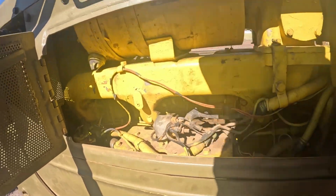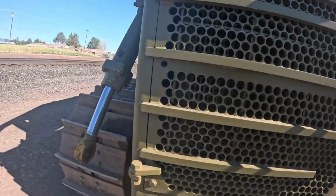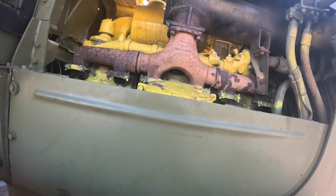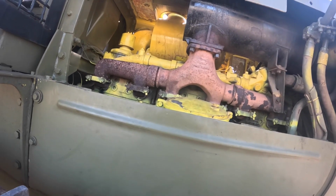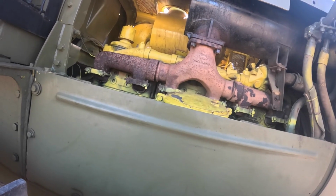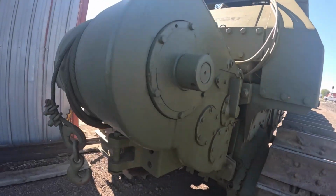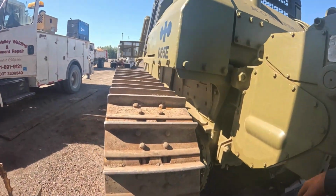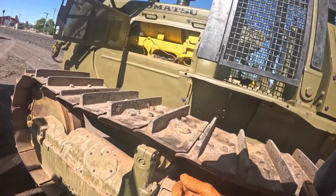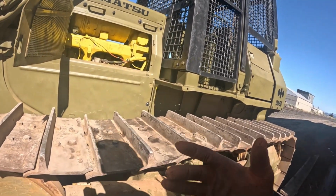And the other thing... Okay, figured out how this tank works and what the purpose of it is. Okay, the whole purpose behind this tank, and now I know why I have that fuel knock after I shut it off and go back to restart it. You kind of have that fuel knock and that big black smoke come out. The design of that is, the tank is obviously sitting higher. On a regular injection pump, this has a Cummins PT fuel pump in it, most of the time you'll either have some kind of vane pump and then your distributor pump, or an inline pump with plungers and delivery valves, and your rotary pump's going to have delivery valves as well.